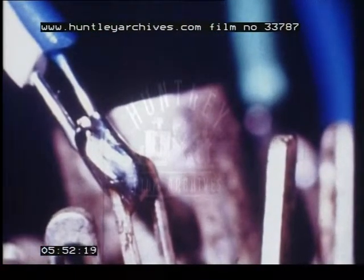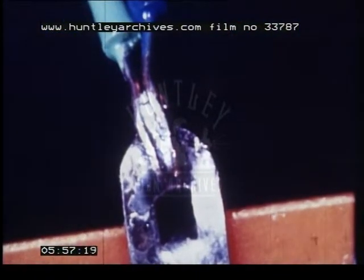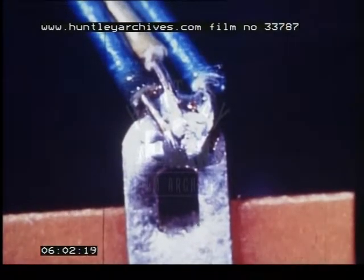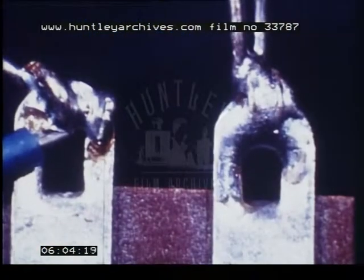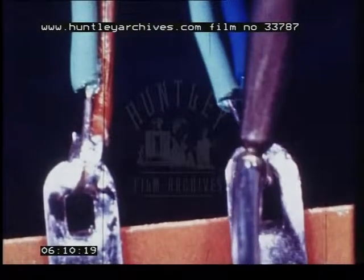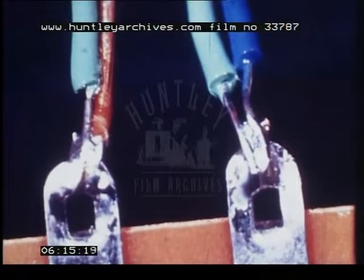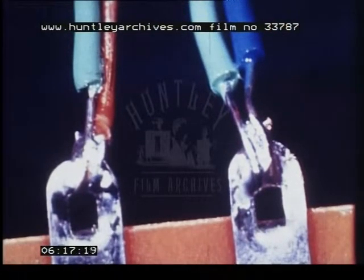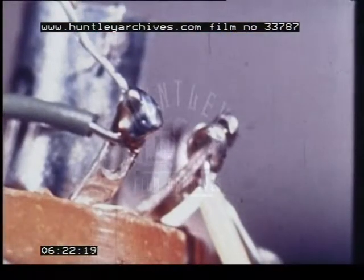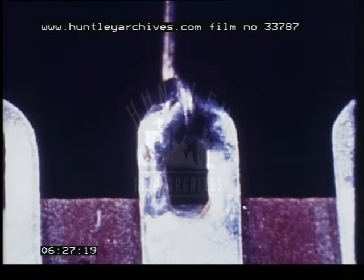If there are one or two connections to one soldering islet, this need not entirely be filled with solder. Where there are more than two connections in a single islet, it can be soldered as shown or even completely filled. The space between the tag and the leading out wire is always filled with solder. By working in this way, you will get good joints. The layer of solder applied is not too thick, the leading out wires may still be distinguished, the risk of short circuiting is avoided, and the surface displays a silvery gloss and has a concave shape.